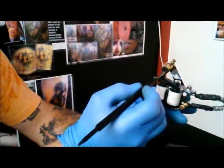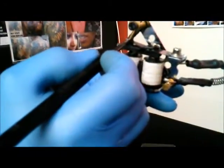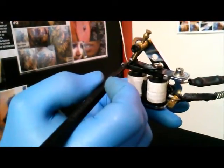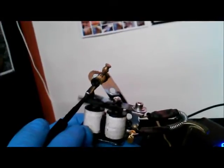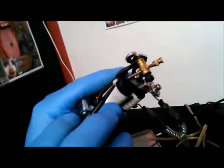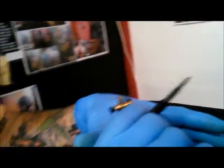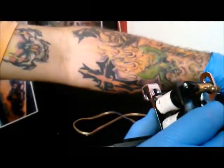This screw is hitting pretty flat on. It's not hitting at an angle or anything like that. It's hitting flat on the front spring. Okay, it's not just hitting the tip. And that gives us, we're still at two circles here, figure eight, two circles just barely touching. And we're still at the same voltage. This is 6 volts. You could turn it up a little bit.